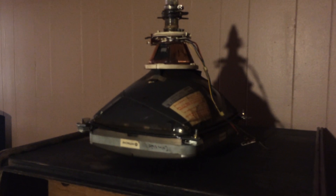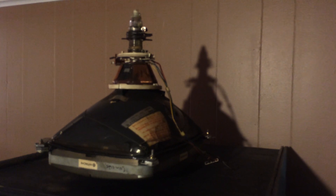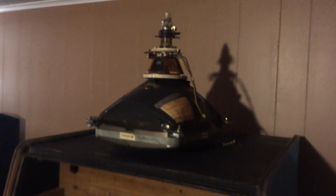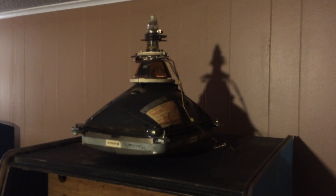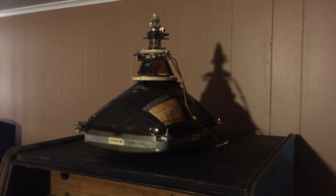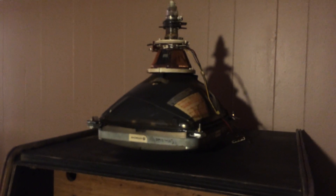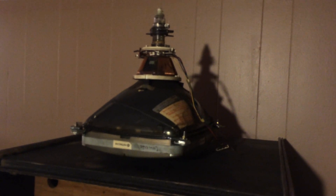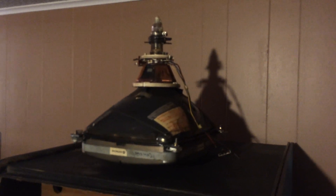I plan to put the CRT back — the CRT is actually over here. It's a Hitachi, it's a Toei 13-inch monitor. It's really one of the more pain-in-the-butt monitors; people kind of cringe when they hear it. But the tube looks okay — it has a tiny bit of burn, not a big deal. Upstairs I have the chassis and I'm still capping it and changing things out. A couple solder pads fell off, so I have to wire them up to the points I need. So that's going to take a little longer than expected.